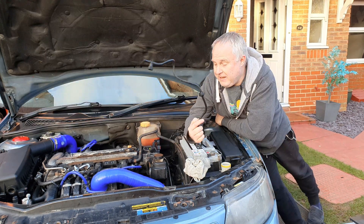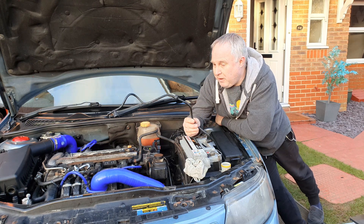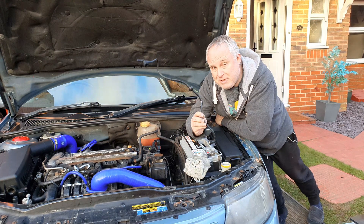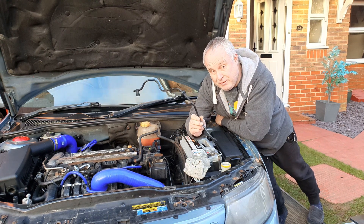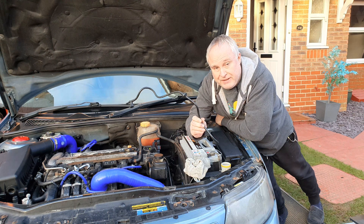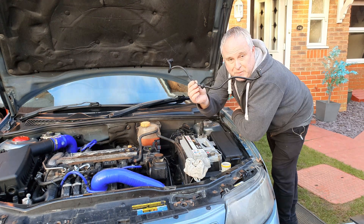The example I'm using today is my Saab 93 brake booster vacuum pipe. These go hard and brittle with age, especially on the V6 engine version, and then they split and break — and of course you lose your brake assistance and your engine runs rough thanks to the vacuum leak. Let's get to putting one together.